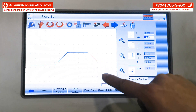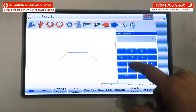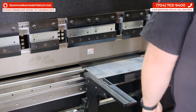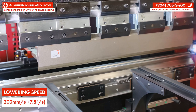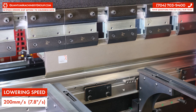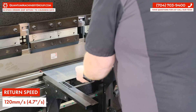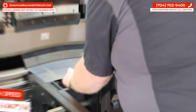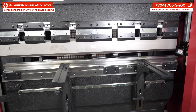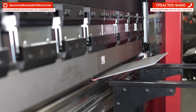The CNC system also takes safety of the operator and machine into account, so it will notify the user if the bend will make contact with the machine. The machine has 200 millimeters per second down speed, 8.3 millimeters per second working speed, and 120 millimeters per second return speed, making it ideal for mass production. Users can have multiple stations to optimize the workspace and do multiple bends without having to make adjustments.